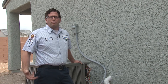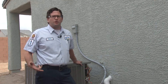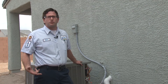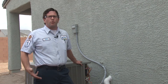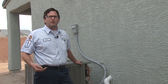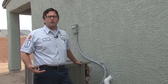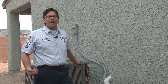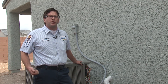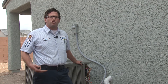Here in Las Vegas, another reason you're going to want the Start Assist device installed is that there are 2 million people in the valley, with hundreds of thousands of residences and businesses all running air conditioners. In the middle of summer, the voltage that NV Energy supplies can end up being a little lower than the target we're looking for. With a lower voltage, it makes it tougher for the compressor to start. We get brownouts occasionally, power surges, and voltage drops, and having the Start Assist on there helps the compressor overcome those tough start situations.